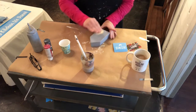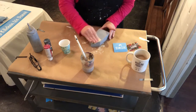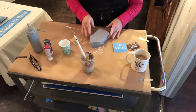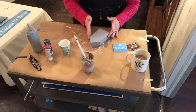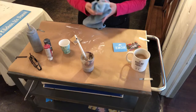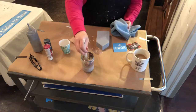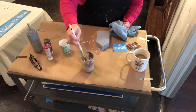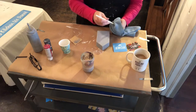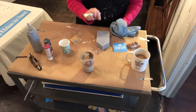You don't have to do that — I just kind of like the way it looks. What you want to do so your stencil sticks is, with the grain of the wood which is top to bottom, you want to just sand it smooth so that the stencil will stick. Because when you paint it, it raises the grain of the wood, makes it nice and bumpy, and the stencil doesn't lay flat. So I'm going to wipe it off with a rag. I usually use paper towels in class, but since we're conserving paper products right now, I have a lint-free cloth. I'm also going to dry my brush really well so I can move on to the other paint colors — you want it really dry in between colors so the paint doesn't run underneath your stencil.